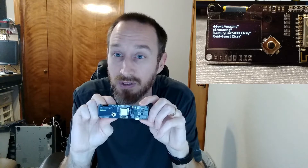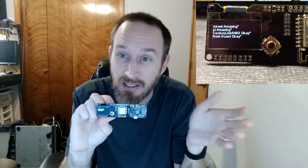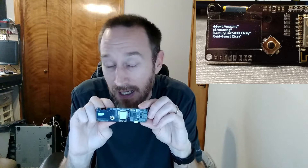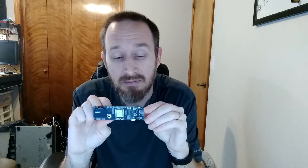Those signal strength conversions were taken specifically from a website I found. Whether everyone agrees that a given strength equals a particular usability level, I can't say — it was the first one I found and it was easy to implement. I will link the code I'm using so anyone who wants to reproduce this can. For $15, this device will work great. One shortcoming, though, is that the ESP8266 only does 2.4 GHz. That was a downside for my buddy because at his new place of employment they've been moving everyone over to 5 GHz — so while this won't work perfectly for them, it will continue to work for me or for our network engineers at my current place of employment.